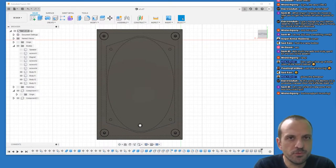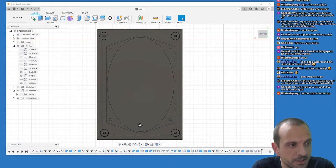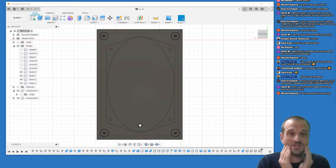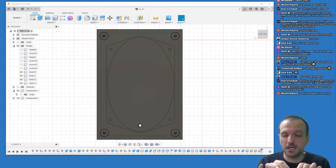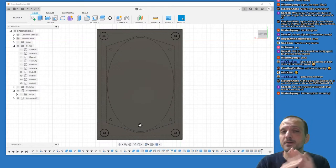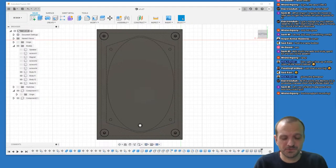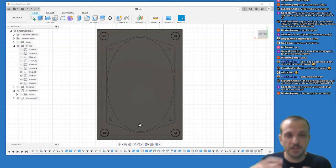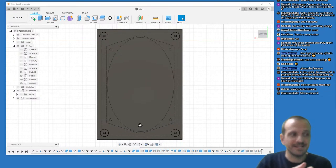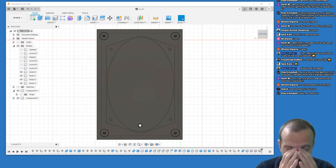Electron Ash. If you remember all the variants of the RetroNet, I used the ESP8266. The Wemos isn't really cheaper than it, but there is a big problem with it. The Wemos is good from one standpoint in that it saves you a certain amount of manual placing down, because oh my god, the amount of time, how long it takes to do these things. It's insane. I was going to give up and just say, what's the point, just waste your life soldering. So I decided to use the Wemos module in it. But the problem with the Wemos module, when you start doing that, you're talking about a multi-layer sandwich board. It makes debugging a nightmare.